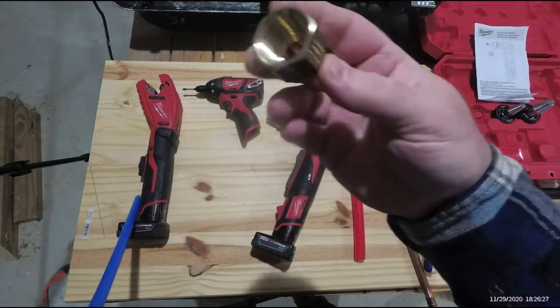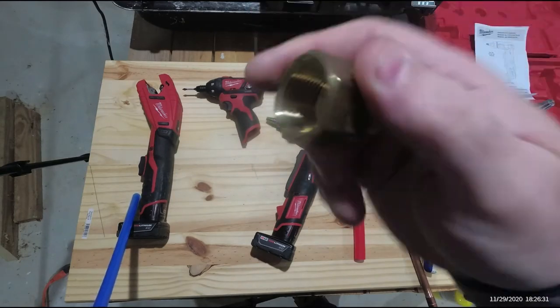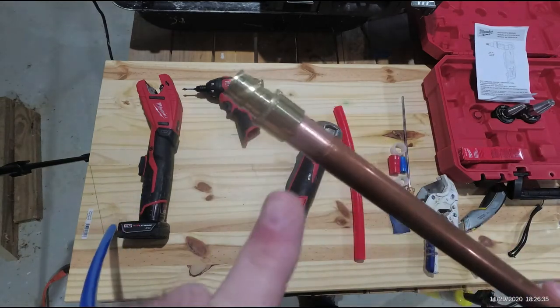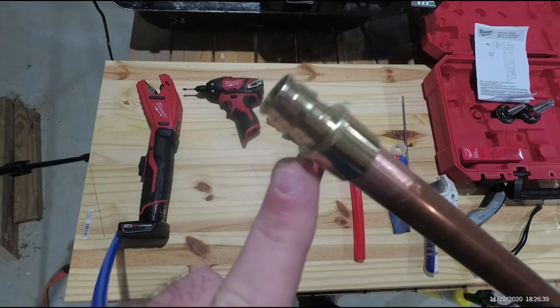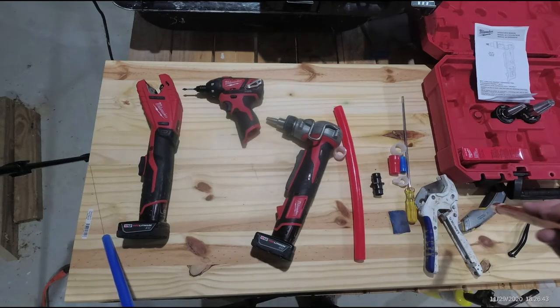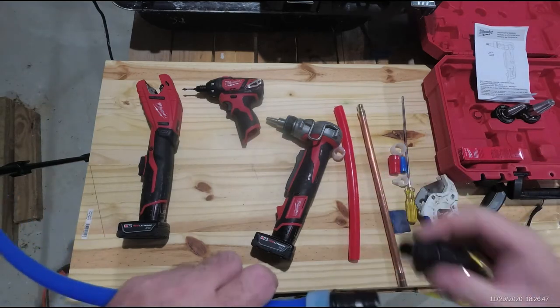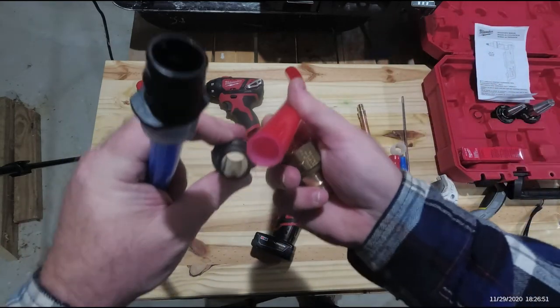This is where you can adapt it to regular iron or copper pipe — you can thread it to threaded pipe. This one is a female sweated fitting that lets you adapt to half-inch copper, and you're not really losing any flow because it tries to stay the same size as the pipe when you expand it — they're the same size inside.